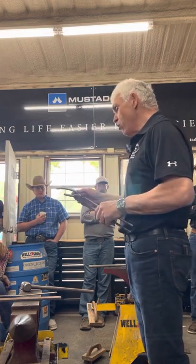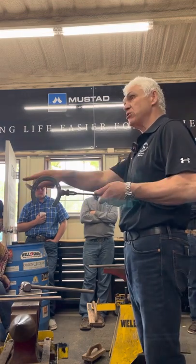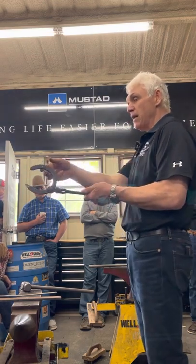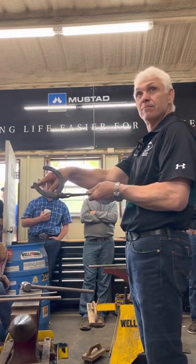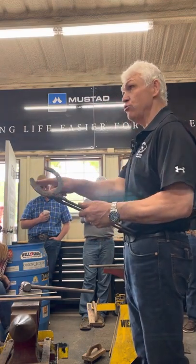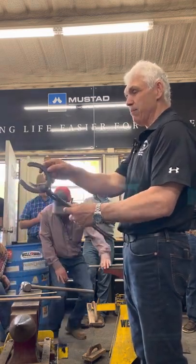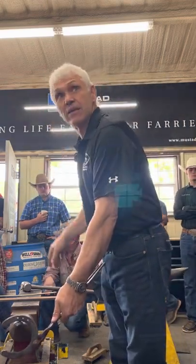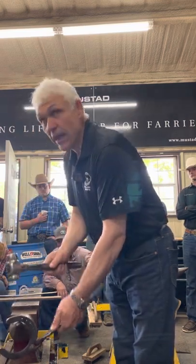When I hold my shoe, I always hold my shoes in the direction that I'm working. So if I was working the toe, my tongs face the toe. If I work my branch, my tongs face the branch. And as I get to the heel quarter, I let it slip, and my tongs face where that shoe's going, okay? So you'll see it in the handmades, but I hold it where the shoe's going, not where it is, because that's where the branch is. I'll let my tongs slip, sorry, this way. So can you see now I've got a good posture? Okay, I can hit here, I can hit there, I don't have to move much.